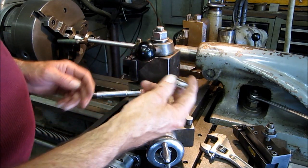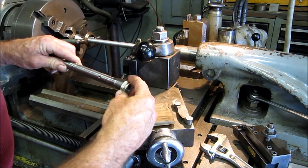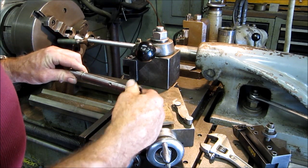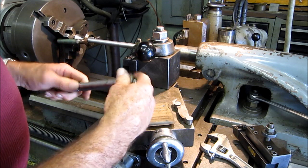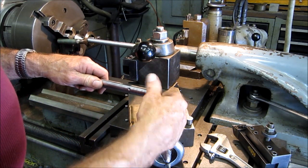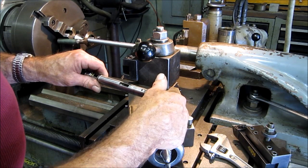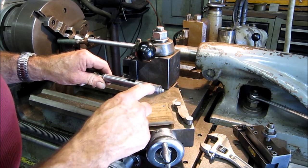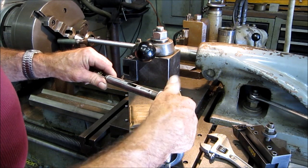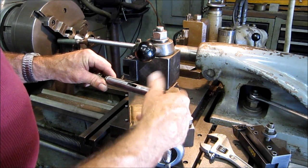Usually I have the female that's going to be my test nut, and I'm gauging the fit of that nut. This is a lock nut, so you want it to lock, but you also want a certain amount of it to be free, and you want your thread to be the right size. Now I'll also find a 3/4 inch 16 full nut, and I'm going to have that as a test feel as well.